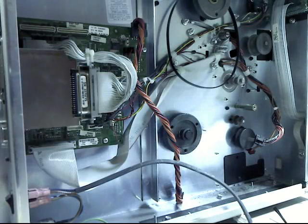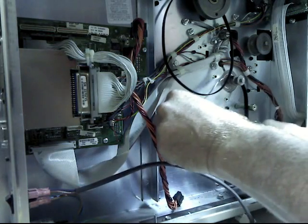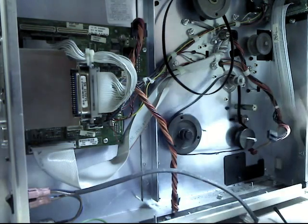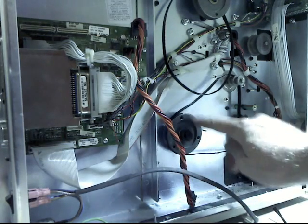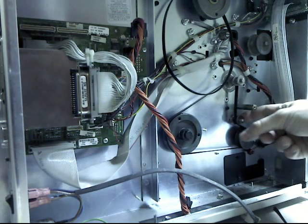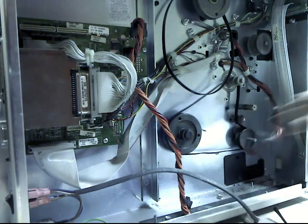With that belt out of the way, now we want to line up our belt for the take-up. It goes this way. There we go. So that's the proper routing. So now we've got to unscrew the 3 bolts that are behind these holes, move this all the way back until it's tight, and then we can also use this to make final adjustments to get the tension right.